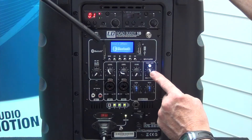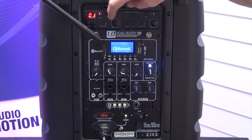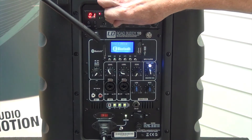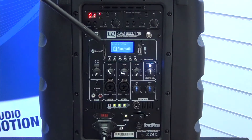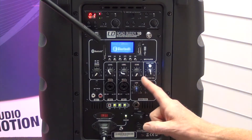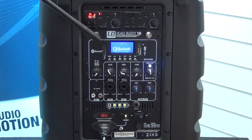Here we've got the maximum volume control, which is the power and little limiting light. For the microphone, there's an input volume control on the actual transmitter receiver, which you can increase or decrease the overall balance of sound. You can alter that in combination with your microphone and the maximum volume to balance with your music source. Just slightly below that, we've got the low frequencies — your bass — and the high frequencies — your treble. That's a global EQ that works across microphones and music simultaneously.